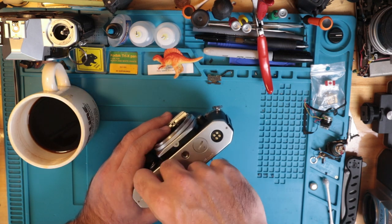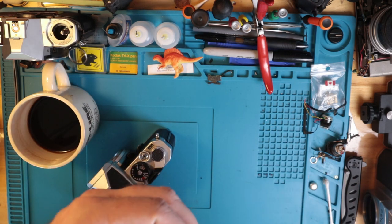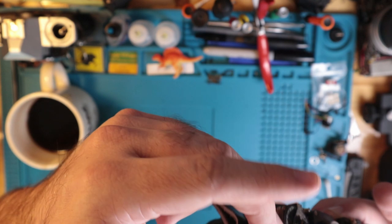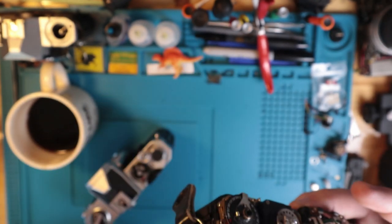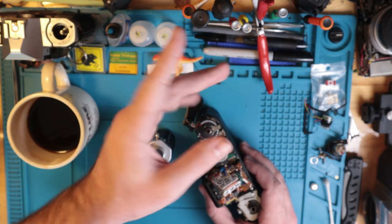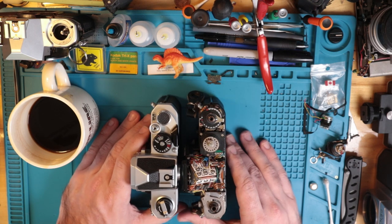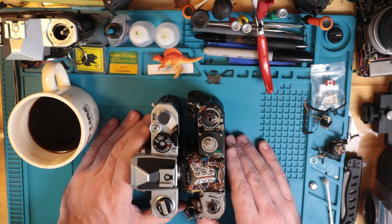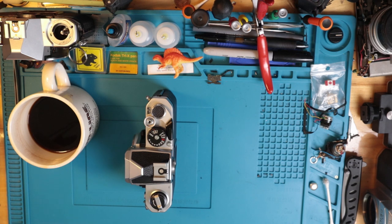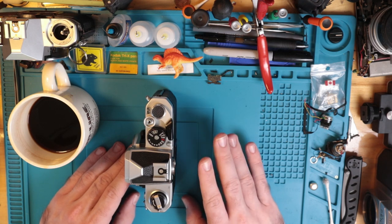This FE actually has a relatively similar issue except the catch here is not the issue at all. There was a dent taken out in the top and something is not catching in the top, so you can continue to advance it. It's very delicate and fragile, and instead of using one piece they use like six, so it becomes incredibly frustrating to service these cameras. The idea was you would send it in to Nikon and they would fix it, but I don't think Nikon's really going to fix these anymore. It's been a riddle and a puzzle to solve, but it's enjoyable.